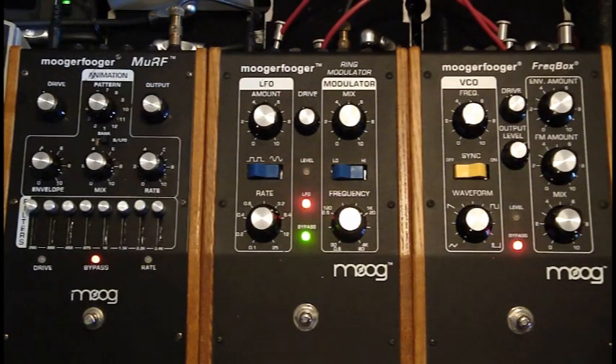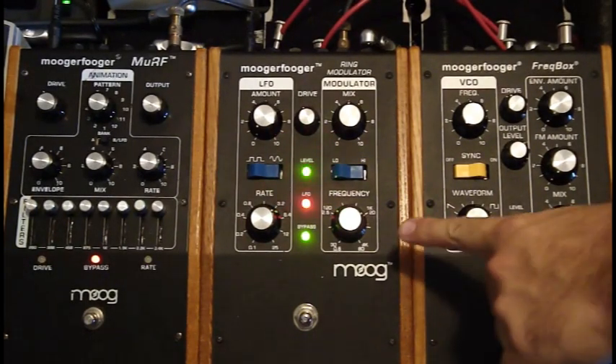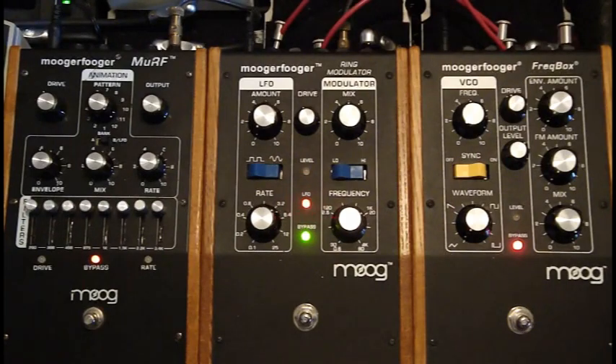What we can do is we can actually change the carrier oscillator. The carrier oscillator is what the ring modulator pedal uses to add and subtract from your input signal to get that crazy tone. But what we can do is we can actually use a different input signal, sound source, as a replacement for the carrier oscillator. So that's what the carrier input is for.